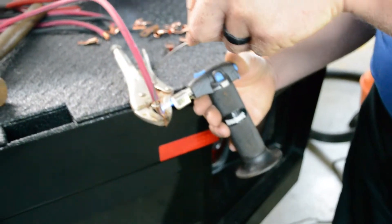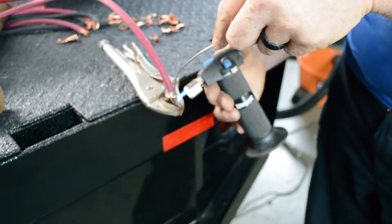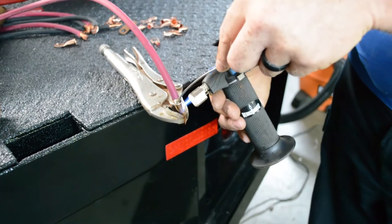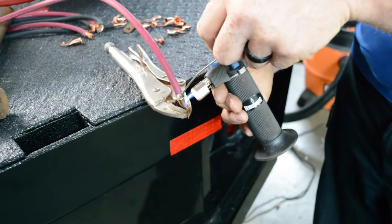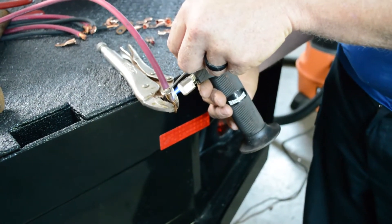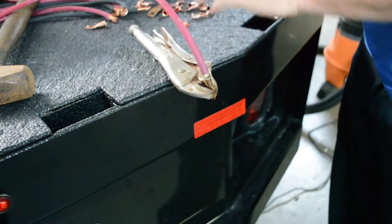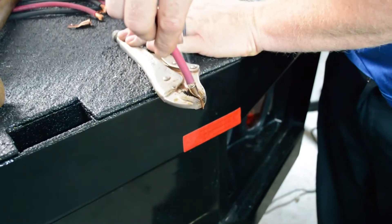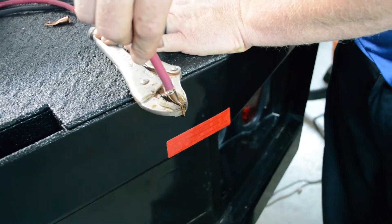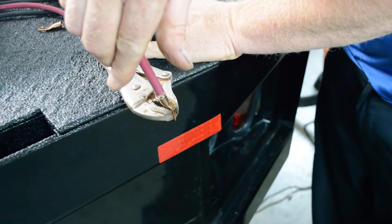You just fill this thing up so it's full of solder all the way to the top. That way we know we've got a good connection. This will actually go pretty far up into that wire. Once it's full of solder, take the other hand and just push it in there to make sure. It's pretty hot right now — that solder is all the way up where my fingers are, I can feel the heat up that far. We'll let that cool down.